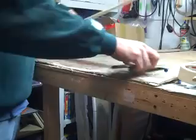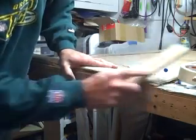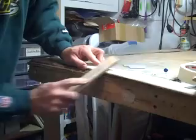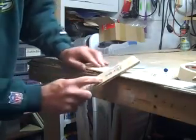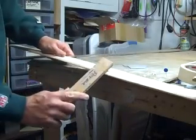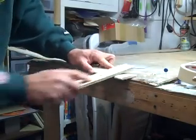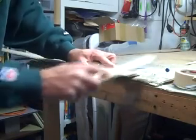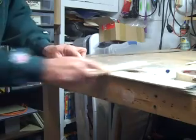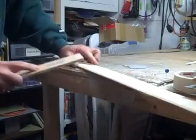We're going to go back to the leading edge side and do a steep angle here — this will help get that radius in. Our wire is actually going to be touching the beginning of where I'm sanding. So I'm sanding like a compound angle — one here, one here. Now I'm going to go real shallow and try and connect from here to that line. I actually want to scratch right above that line. If I scratch that line as I'm sanding, then I know that I'm not going to have a flat in the middle of the blade.